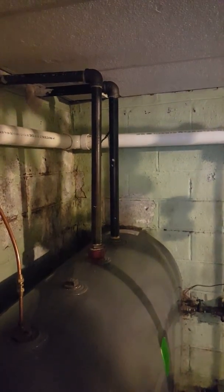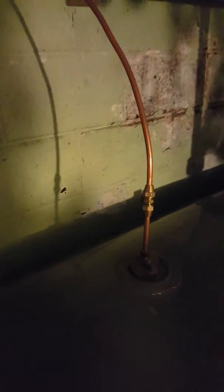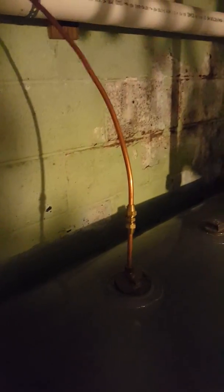We've reconnected his fill and vent pipe to the oil tank. We're top-feeding off the oil tank — that is the preferred way, so that the sediment and junk will lay on the bottom and not be picked up by the heater.